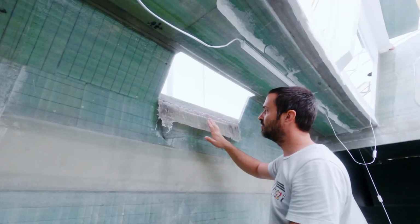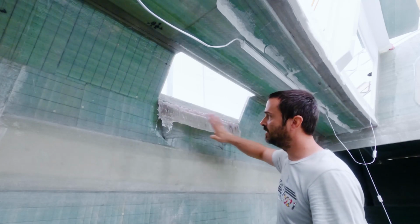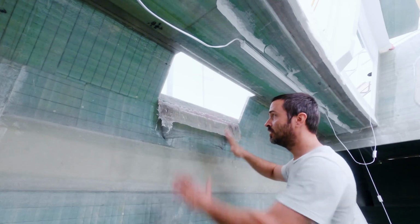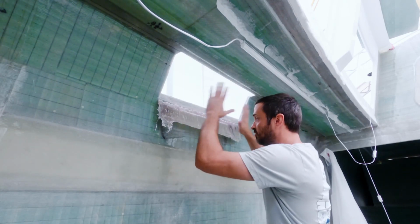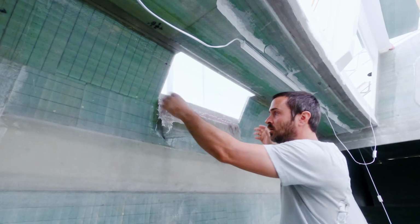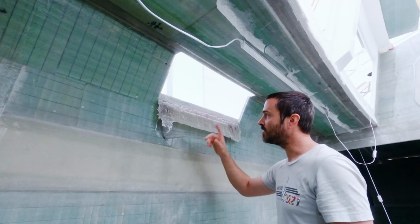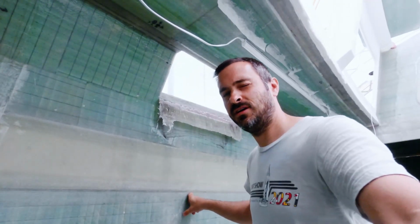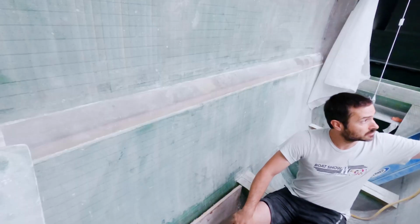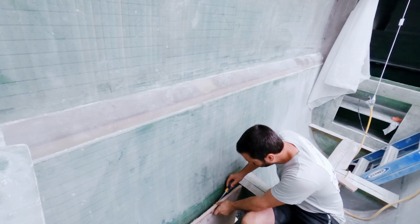Clean up the edges a little bit, and again, this will get methacrylate applied to it along here, and then thickened resin for this area above here. The daggerboard case should then just rest directly on that, pressing in. We'll probably clamp it or press against the backside here. I'm going to dry fit it and check to make sure all this is right. Hopefully I don't have to go through and redo this again, because that was not the easiest process for this one. There we go.